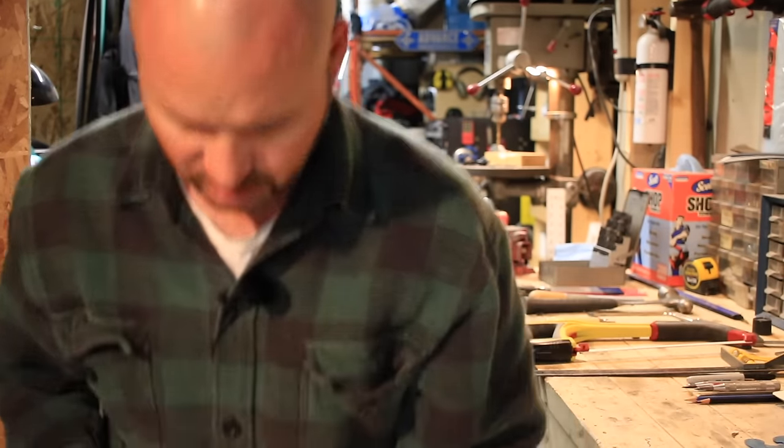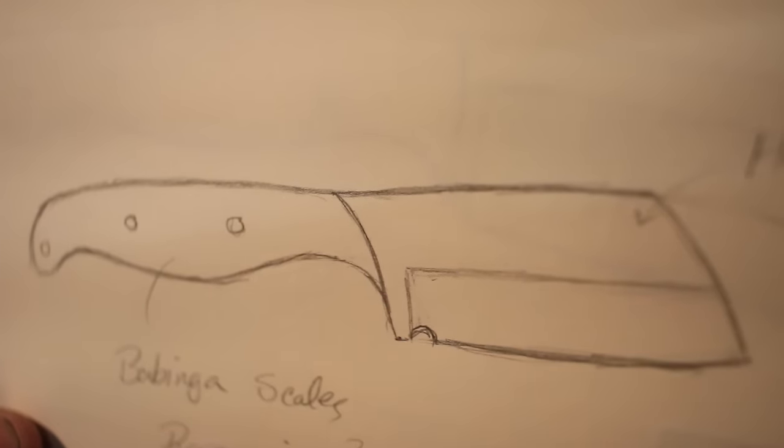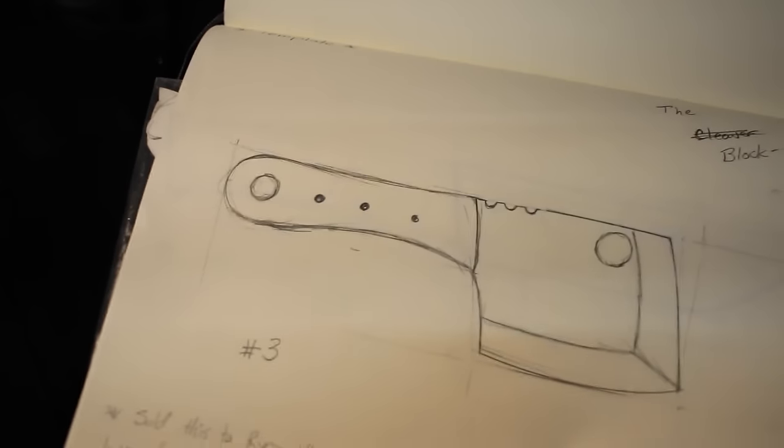I'm going to show you right here — some of these were not drawn freehand. That was done with French curves. I could never draw that freehand, but by manipulating my French curves and other tracing templates I'm able to draw knives that have nice clean sweeping lines and they don't look that terrible. So that would be the first thing I would suggest when you want to do some knife making. When we do this little neck knife, make whatever shape you want — I'm not going to put the template up for this. You could make a bigger blade or a smaller blade. I would suggest when you're making your first knives that they be sort of small — it's just easier, there's a lot less work. If you start out with like a 10-inch blade filing by hand, you might be completely discouraged and throw the thing away before you actually finish it, because filing a knife by hand is a lot of work.